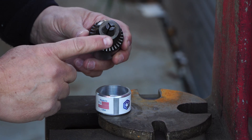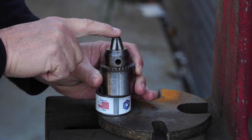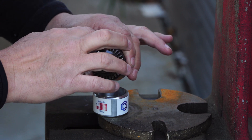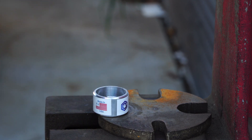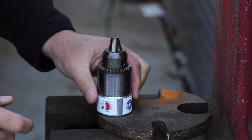Okay, 6A33 over here in the press. These jaws are all flush with each other — they're all the same length — so this one feels like it's going to be rebuildable. There's lots of wood dust down here in these bevel gear teeth. It's dry as the Sahara in there, so let's press it out.